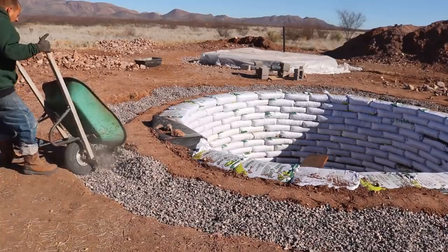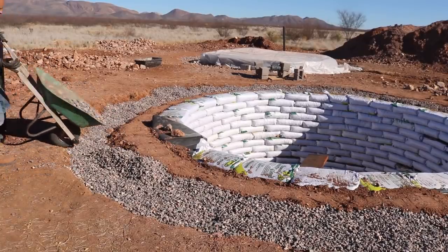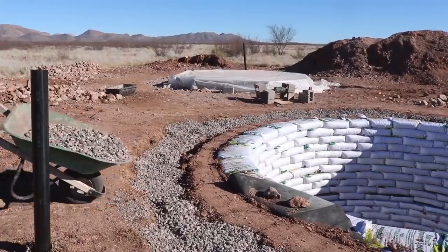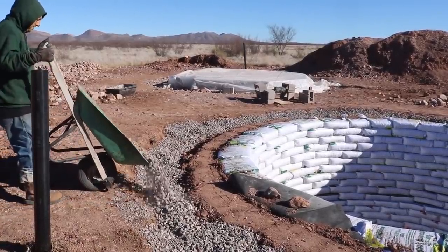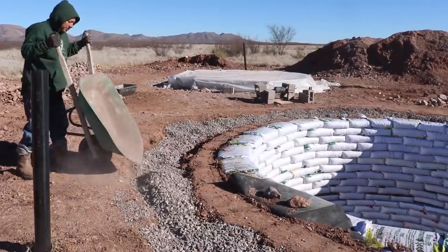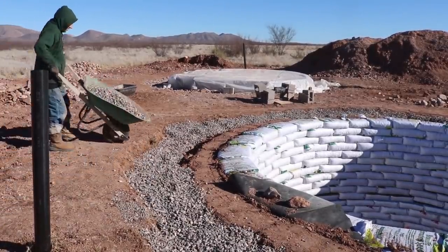Now you've got the opposite here. When you're building an Earthbag home, this thing is solid, especially what we're building, a dome. Once all that earth fully dries out and cures and hardens, it becomes like a monolith, this one solid structure. So it's incredibly sturdy, incredibly solid. So with that kind of structure, you actually want a flexible foundation.